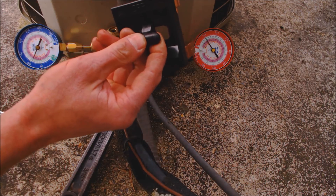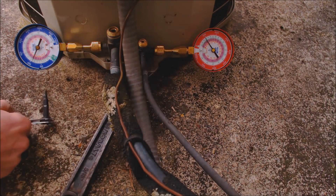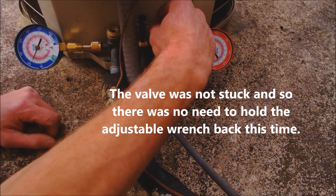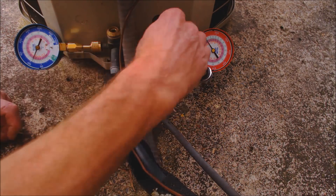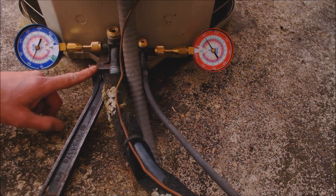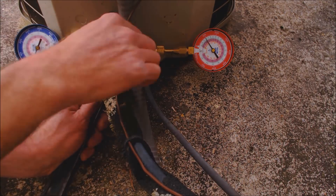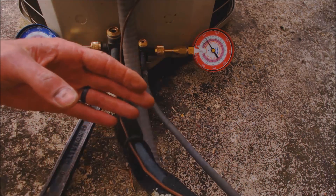Right now the outdoor unit is off and the indoor unit is on. Before we even start, I have my adjustable wrench on the service valve. We're going to make sure we're able to turn it, because sometimes people have it jammed up and when you're in a rush to close the valve, you don't want it stuck. Now we have the adjustable wrench on the vapor service valve and we're going to turn it clockwise just a little bit — okay, that's fine.